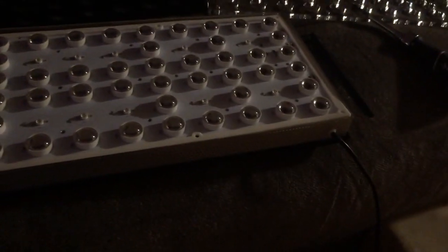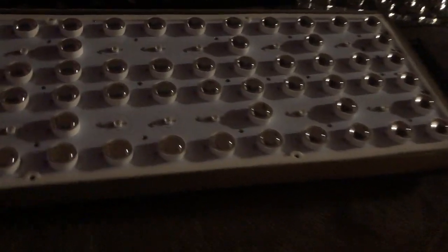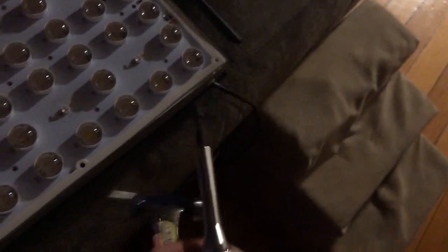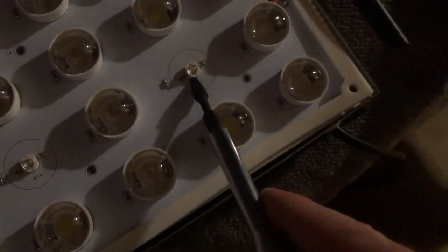The number is 410 — same diode in the exact same position as one of the other V4s I just fixed. To remove it, I get a flathead screwdriver, angle it in right underneath the diode, and tap on the back of the screwdriver. I removed the LED with little to no hassle.